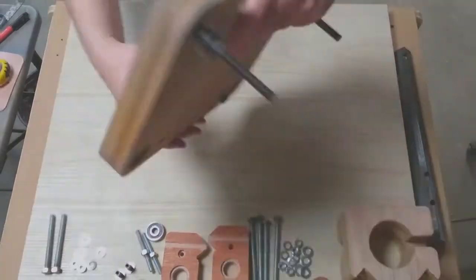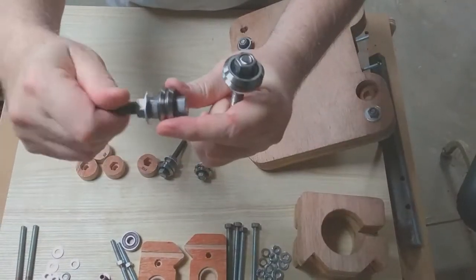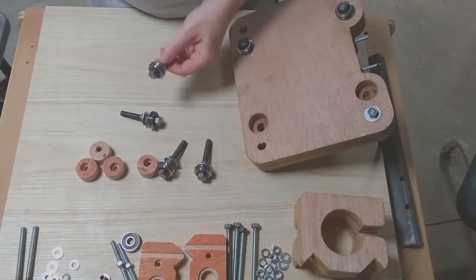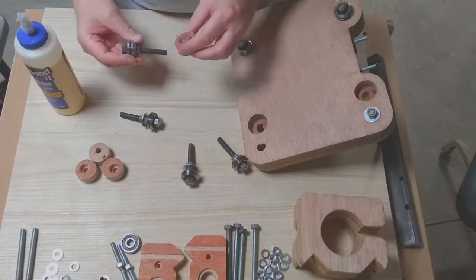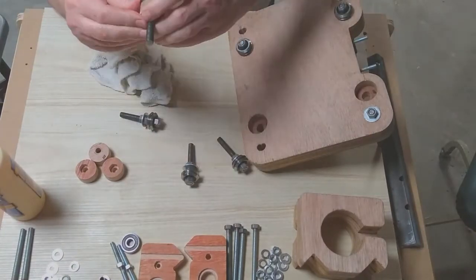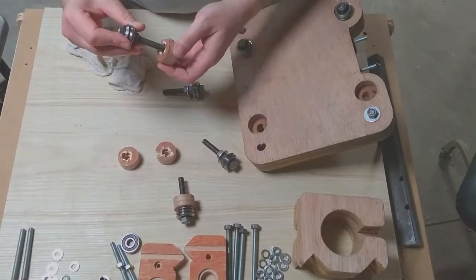Next day. Here are the pieces all glued up and ready to go. Now these are the V-bearings for the X and Y motion, and they fit into these little pieces I machined out, which sets the V-bearings off somewhat. You can rotate them in those holes and get a cam action, giving a nice fine adjustment for tightening the V-bearings onto the angle iron rails.